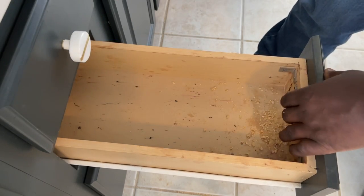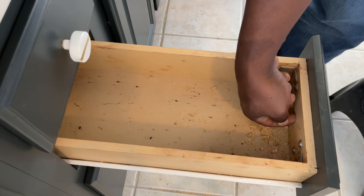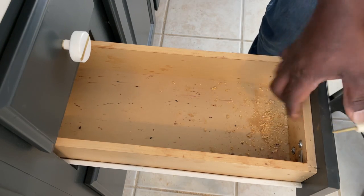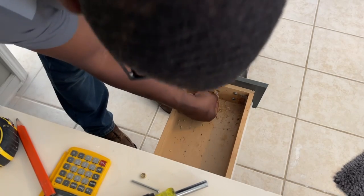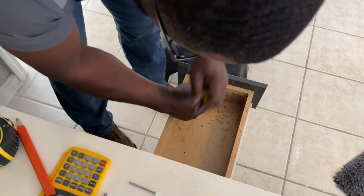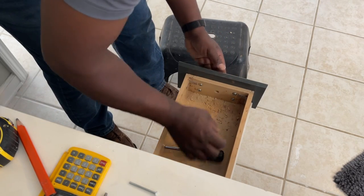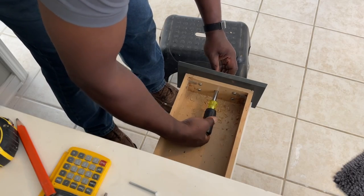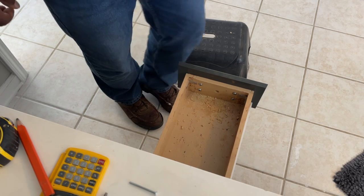You can feel it when you've gone through just that first layer. If you're concerned about going all the way through the drawer front, you can remove the front first and drill separately. Once done, put the knob back through, stick the washer through that recessed hole, make sure you have a nut driver the right size for your nut, stick the nut on, and secure it. Don't go 'Rambo tight' — you'll strip out the knob.